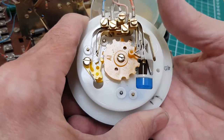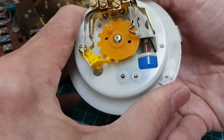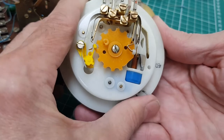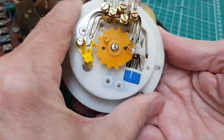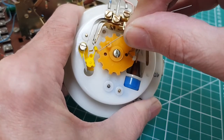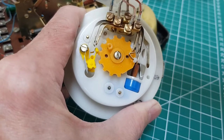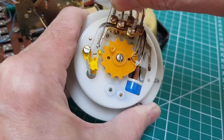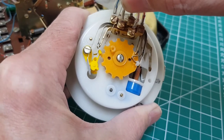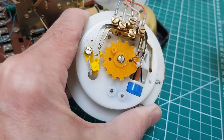The reason for this loss of calibration is, I believe, wear on the contacts. If I turn the dial around and slowly let it come back, when it gets to the maximum height on the cam — you can see the cam there — those are the contacts we're going to adjust. What I believe happens is the gap on the contact heads wears out ever so slightly; it doesn't take much, and that's the area that determines the make-to-break ratio.